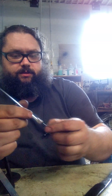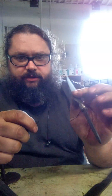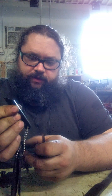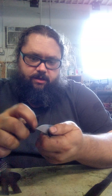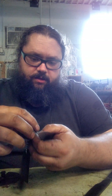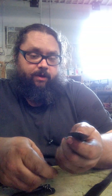This one I'm not quite sure about. This has been heat treated — I don't really know what steel this was, I did it in a class. So it's harder than the 56, harder than the 58, softer than the 60. So it's about 59 Rockwell.